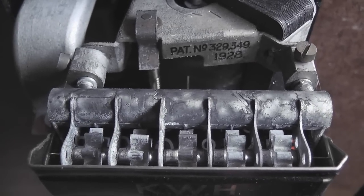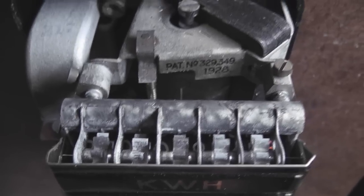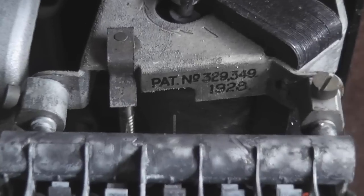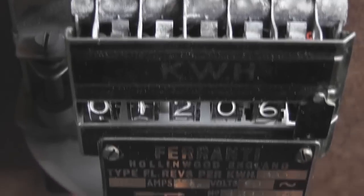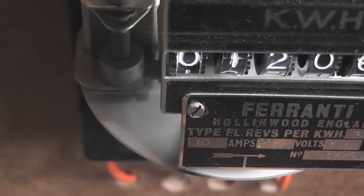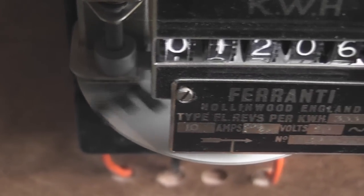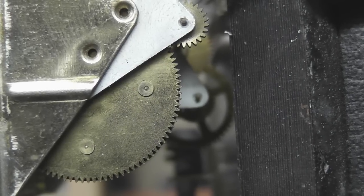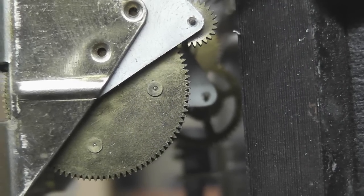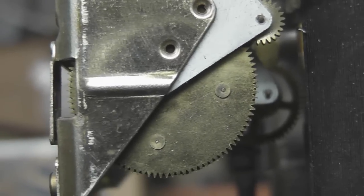The meter's Geneva movements are made of heavy cast aluminium. There is a patent date of 1928 on the frame, so interesting. On the disc is an 'F' near the mark — most likely F for Ferranti. This is the conventional gear worm-to-gear-train drive with an intermediate idler gear, leading straight into the decimal wheel, which is this brass wheel here on this side.